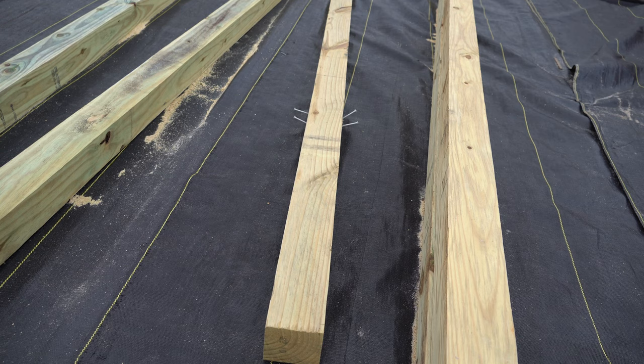For example, if you were burying a 12-foot-tall post, you would have to bury that 4 feet in the ground. If you were using a 9-foot-tall post, you would have to bury that 3 feet in the ground as a minimum. These are 10-foot-tall posts, so by the letter, I'm supposed to be burying these about 40 inches in the ground.